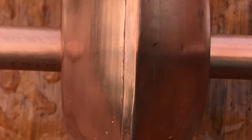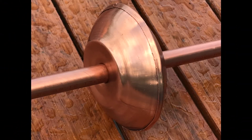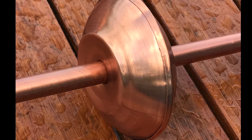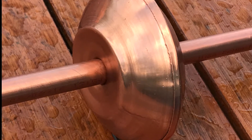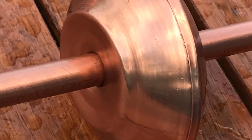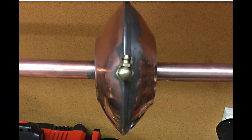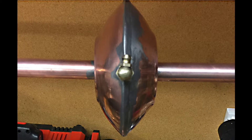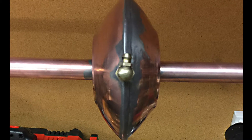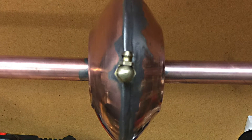Here's the rolled edge. To make the big hole for the pipe going to the center, I made a bullet-shaped tool and forced it through the quarter-inch hole that was there first, which makes a kind of flanged edge on the inside that gives a good area for soldering onto. That was done in the lathe to keep the holes straight. Then I ran solder into the rolled-over edge to seal it properly. In this photo you can see a grease nipple I've placed here — I've taken the little ball and spring out of it so now it acts like a jet.